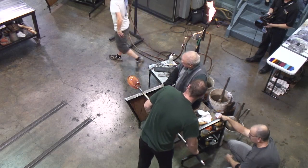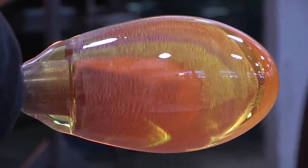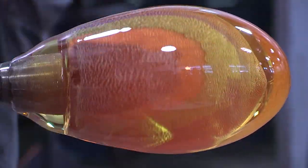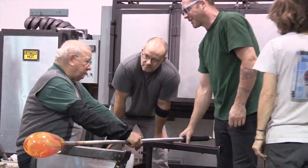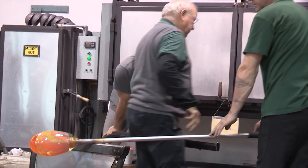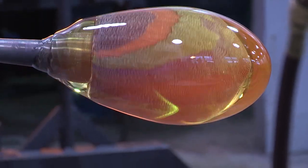If you know something about glass blowing, you might think the long neck is done on the blowpipe. It's not. It's going to be a vessel. It's got a flattened body and a long neck. So to make the neck, he transfers the piece to the punty, reheats the open end, and attaches yet another blowpipe. This will be a record for the number of blowpipe transfers. He attaches another blowpipe to the opening and then pulls out the neck with a blowpipe. It's really pretty amazing to see.